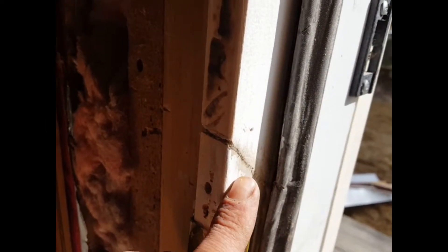We've put the piece in, cut the excess off so it's flushed down, and sanded it up a touch. As you can see, it's all glued in. I've screwed it into the existing door frame at 45 degrees, going down that way, and the same at the bottom — put a trim screw in there at 45 degrees. It's all glued, it's solid.